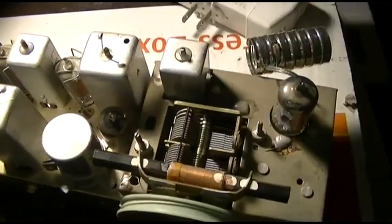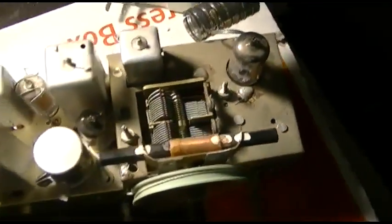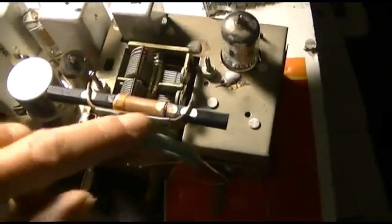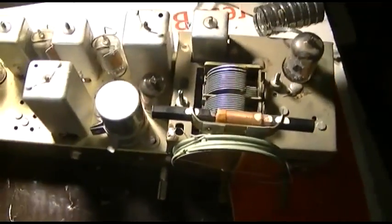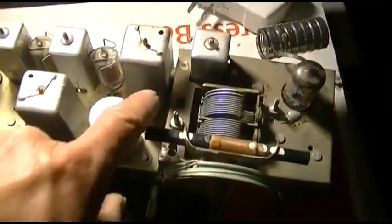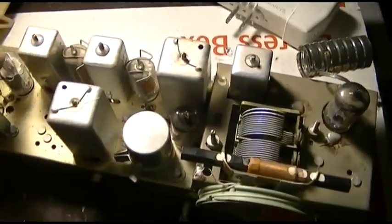So the first thing I could do is try testing the 17EW8 or whatever it was. Some really weird 17EW8. Because this tube does nothing on AM. I pulled it out of there, and before the filaments cooled off, the radio kept going. So this is a converter, first IF, second IF detector.